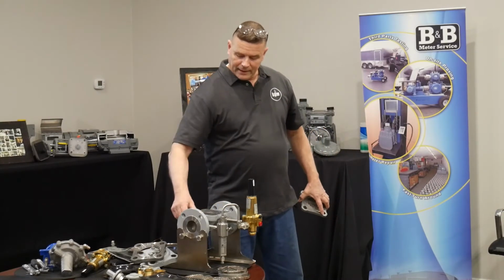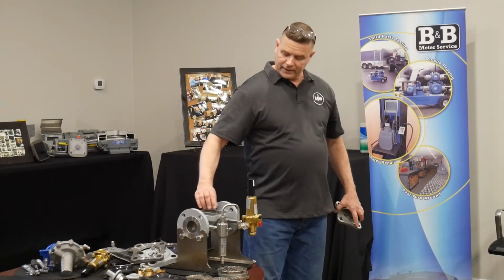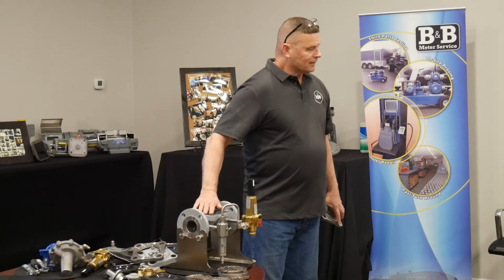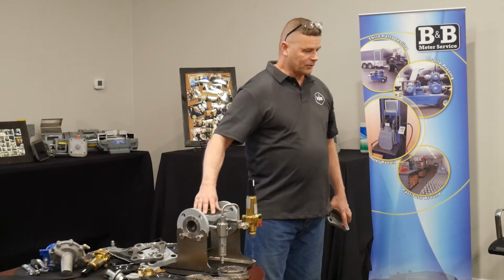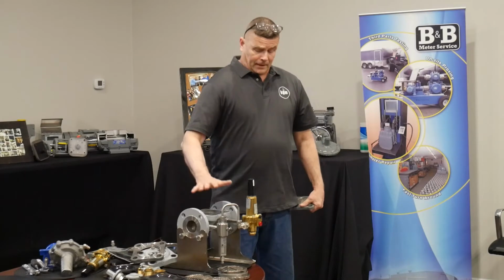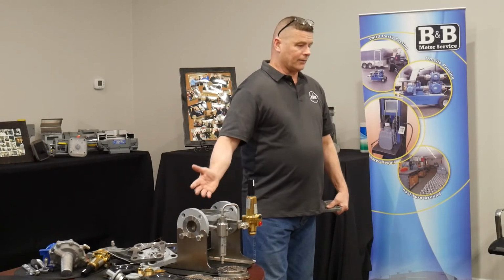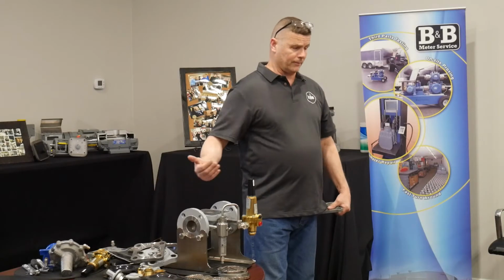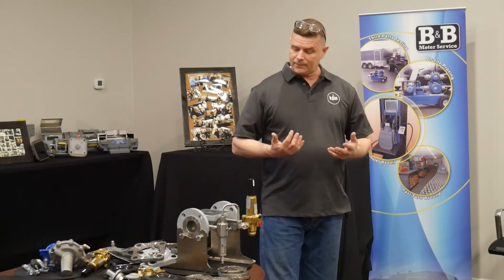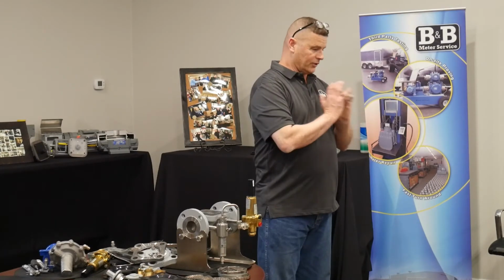So it is good when I can rub my finger across it and it's catching my finger. It hasn't lost its shape or its flexibility. If it gets hard or it basically gets where it's not returning to its original shape, out it comes. Typically when I get in to do inspections, if this system has been down for a while, I'm going to replace these soft goods anyway, because just like a diver, the soft good components that have been under pressure for years are going to get decompression sickness from sitting idle and not being able to effectively get rid of the gas that's trying to escape the material.